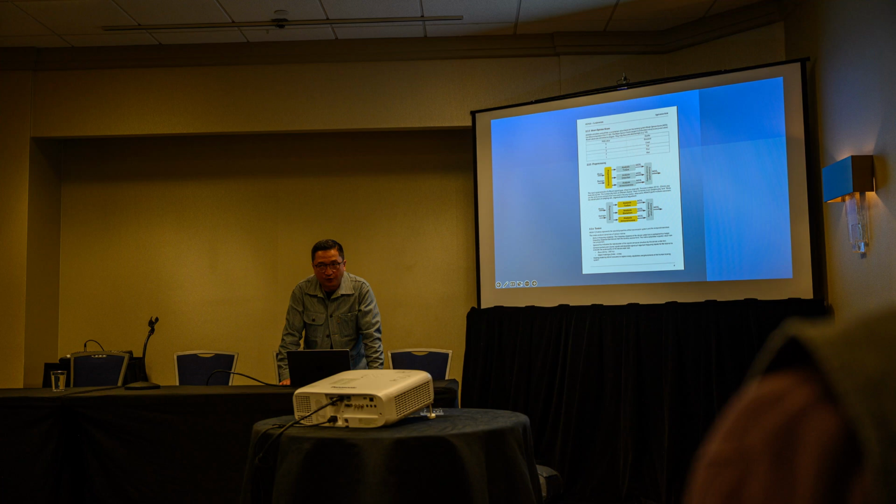So now, if you give me that a Sennheiser HD800S is symmetrical, left and right, any one you have, as long as it's new and it's functioning and it hasn't been broken in shipping, then you believe, right, that all you have to do is run a log swept sine through one channel, because you know the other channel matches, and you know everything you need to know about this headphone.